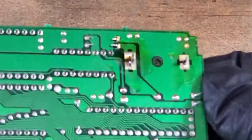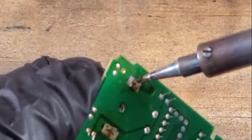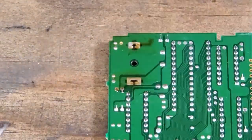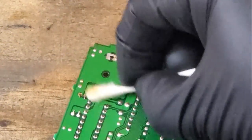That one side still has a little bit holding it in. I could just try removing the rest of the solder, but I'm just going to pull on the battery while applying some heat. There we go — the other side is free as well. I'll just clean up any solder that's still on there, and again, using denatured alcohol, clean up those solder joints to prep for the new battery.